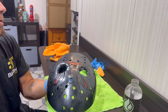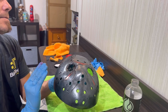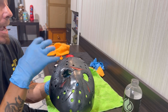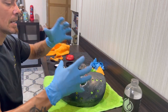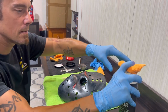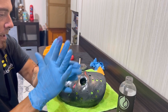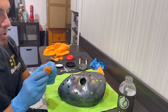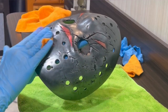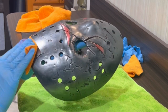The Rub and Buff looks pretty cool, and you may be happy with the way this looks. I'm going to try to blend it in a little bit just to give it a little bit more uniformity. The actual Rub and Buff is a little bit more watery so it tends to blend a little bit differently. You can play with consistency and see what kind of pattern or effect you're going for. I'm going to knock it down a little bit with just a little bit of mineral spirits to kind of get some more of the black to come out. Get a fresh piece of towel — you don't want to use one of the others — and just basically a dab, spread across the towel. Don't spend a lot of time in one area; you're just massaging it over the surface to kind of knock some of it down, looking for areas where it's put on a little bit thicker, and it'll start to bring that black more to the surface.